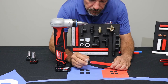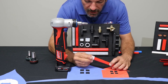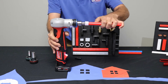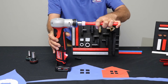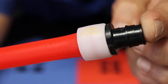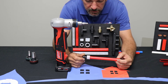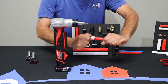It has three little stops in there so it'll only go on one way. You put that on the end of the pipe and then insert it into the expansion tool. You're going to get a good stretch on it and push that fitting all the way in. As we speak, this joint is compressing back — it is trying to return all the way back to its original size. It doesn't take very long, and then it's in there and it's not going anywhere.